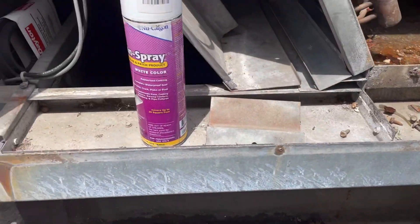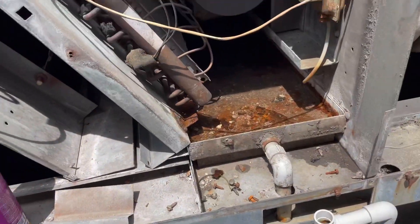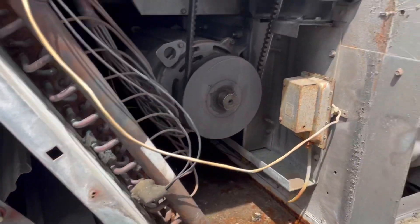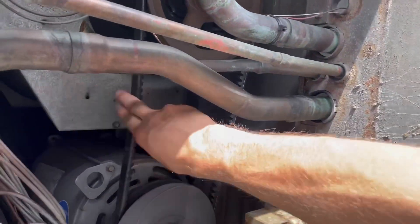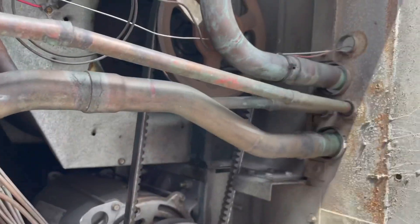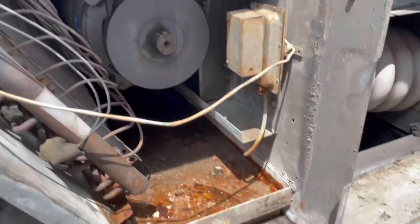Went downstairs — it's leaking from inside the ductwork. I traced it; it's not coming from the roof at this time. Our filters are clean, we're looking good. The coil does need a good cleaning, not too concerned about that. The belt is relatively snug; pulleys were not warm, so it was not slipping.